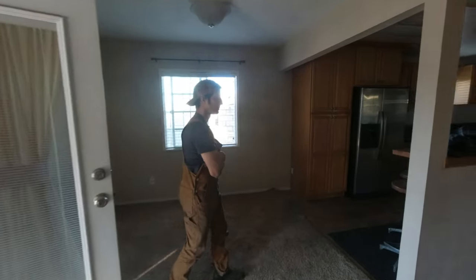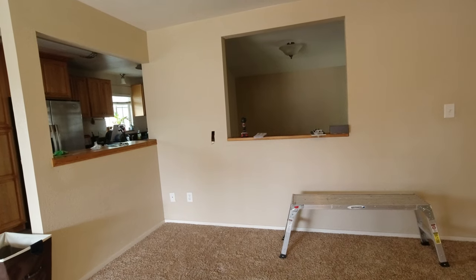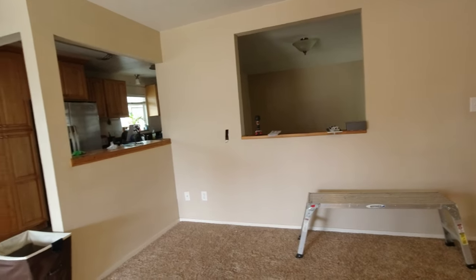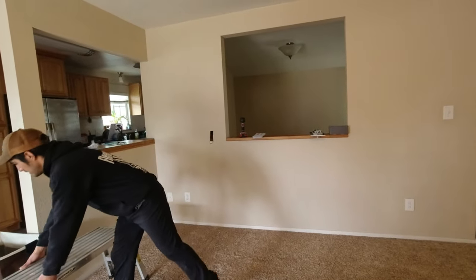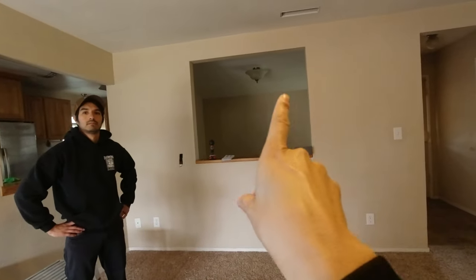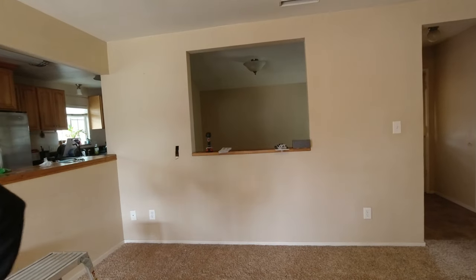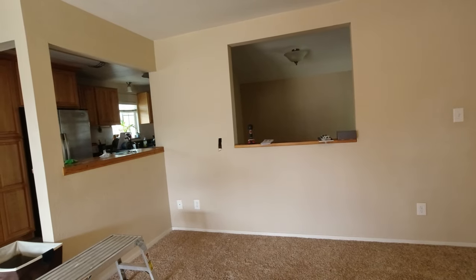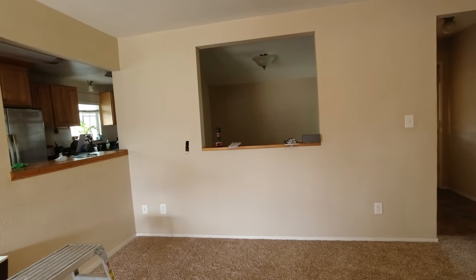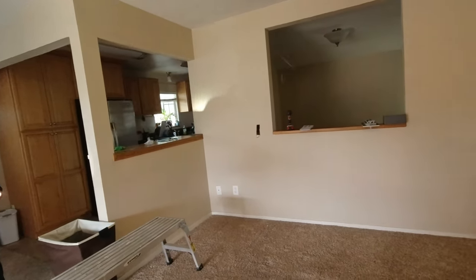So he's contemplating - this is his contemplating phase. We mentioned in the last video that all these walls were load-bearing, and we have come to the decision that we are going to remove this wall only. We did get a quote to have someone come and install the beam in the attic, but we are tasked with doing basically all the demo work so that the contractor can just come in, put the beam in, and be done.